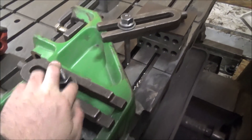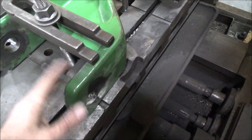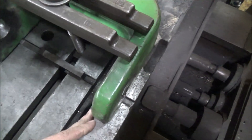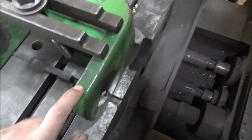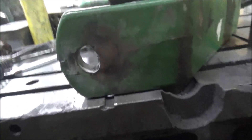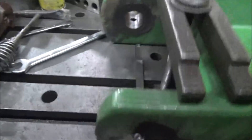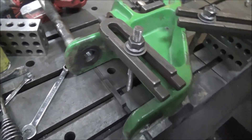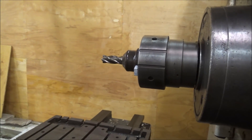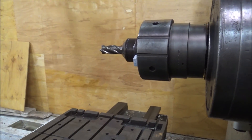Now I've got this clamped down and I'm on the ears, so hopefully there shouldn't be any chatter. Plus this is way thicker than that other piece I had trouble with, and again we're working with cast so not the same vibration issues. If I can put that hole back where it belongs, I'm going to start with a little end mill to kind of open up a little bit of the material and then I'll get the boring head.